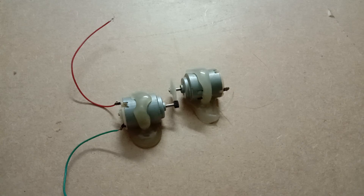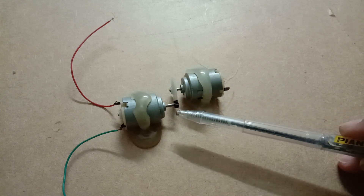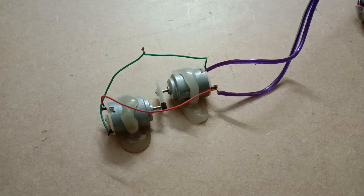I have glued the motor and generator to the base. I've attached a 16-teeth gear to the generator and a 42-teeth gear to the motor, so that the generator rotates 2.625 times faster than the motor. Now let's power the circuit — you can see my generator is running and I can even power my load.